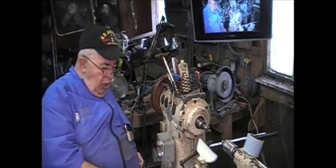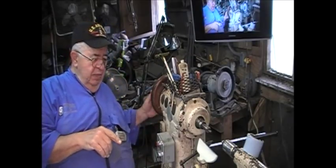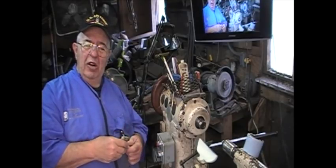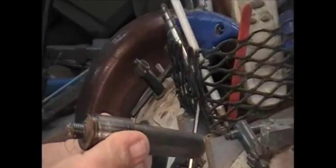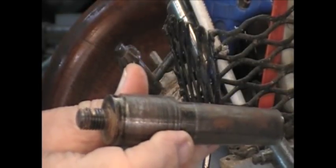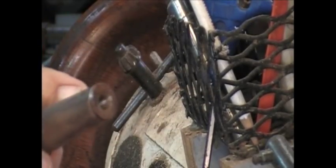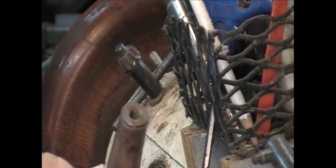Now, when I'm talking about the Ruth Niles project, which I am, I'm doing Ruth Niles bottle stoppers, I'm using her collet, or her mandrel. I'm using her little mandrel. Okay, this is the mandrel made by Ruth Niles. You see that? 3/8 inch 16 bolt sticking out on one end, right over here. Number 2 Morse taper sticking out the other end, and it is drilled for a 1/4-20 drawbar. You ever see that? There you go. See the threads in there?